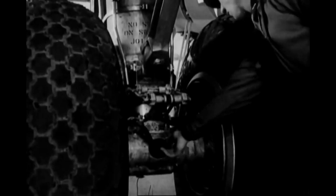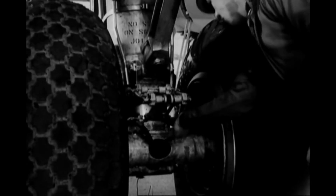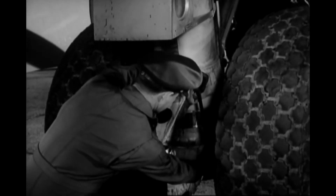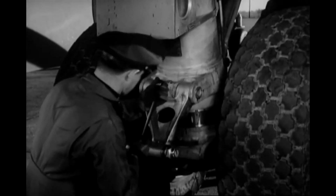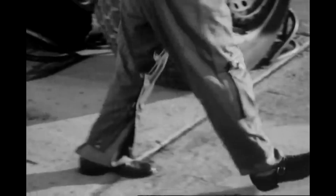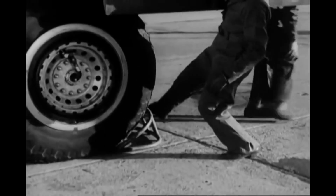He looks it over and inspects the brake lines, making sure that the hose is not chafing and no fluid is leaking. Meanwhile, you're checking the clearance between pin centers again. 13 1/4 inches. Right. Now, are the wheel chocks in place? One behind the inboard tire and one in front of the outboard tire, just as it should be.